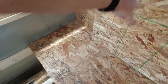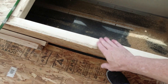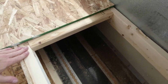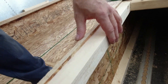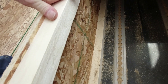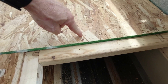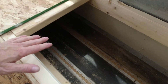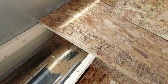When I say I put the seats in, basically what that means is I put the framework in — this is the base for the seats, but these are not technically the seats. You can kind of see how I've done this, but basically all it is is a piece of OSB, 13 inches tall, with a two-by-two across the top and the bottom. That's what makes my walls. Then I go back and put in these little cross beams — the smart thing is to put them right there so you can run a screw in, or you can turn these into lift-up storage hatches or whatever you want.